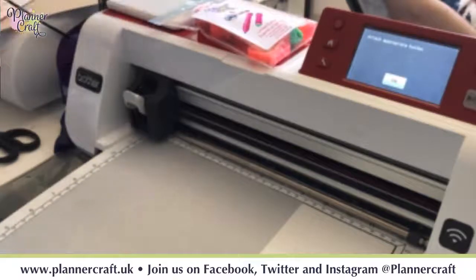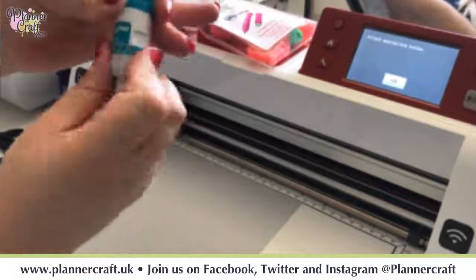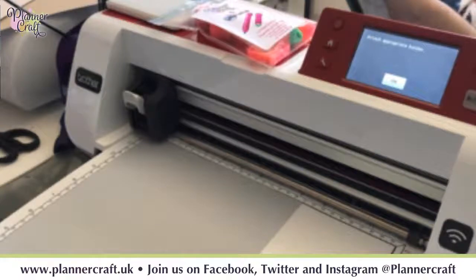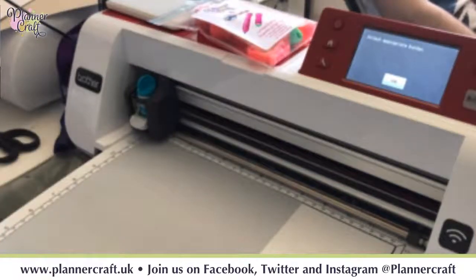Doesn't always help if you put the blade back in. So if you've had your cap off your blade, just always make sure that you go back past 12 so you know that it's in the right place, and then back to your normal blade settings, so in this case 5. I did do that for you. Yeah, I wanted to do it on video, because I don't think we've really said about that while we've actually been working on a project rather than doing the maintenance one. Because we said in the maintenance, definitely.